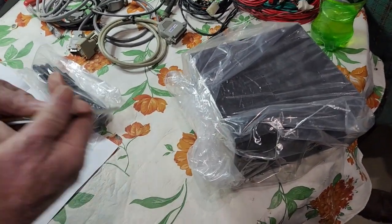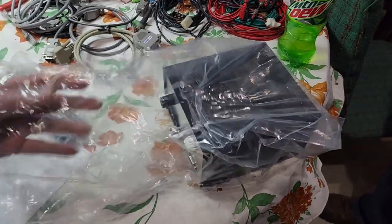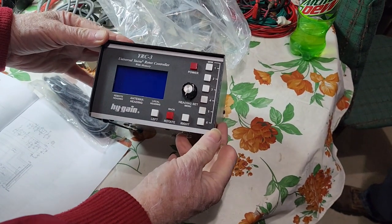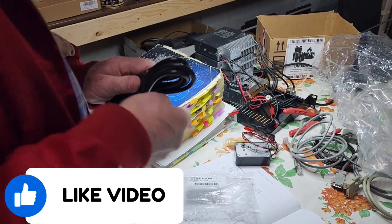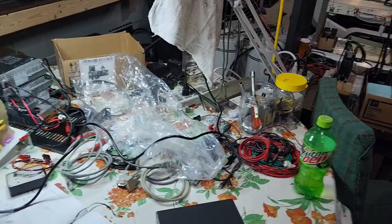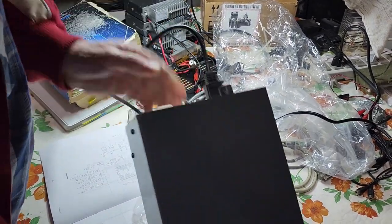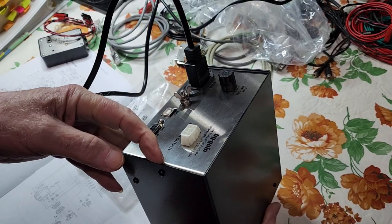We start taking the new controller out of the box and out of the plastic wrapping. The old controller that came with the two G800s that Don, AC4DM, had were bad — in a previous video it looked like a victim of a lightning strike because some components had arced to the chassis. Replacement parts aren't inexpensive, so the decision was made to update to a more compact digital version with memory presets: the Hi-Gain YRC-3. AC4DM is looking at the back — you can see the USB RS-232 and the six-wire connector on the back of the Hi-Gain.